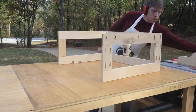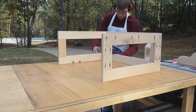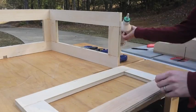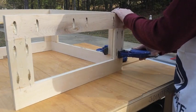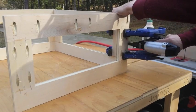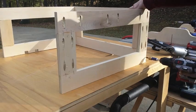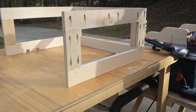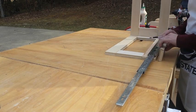And in this shot, I'm about to make mistake number one in the project. The pocket holes that are facing up on the near side of the frame are actually to mount the frame to the workbench itself, and I mounted that portion of the frame upside down, so I had to re-drill those pocket holes later on. Following finishing assembling the frame, I mounted my drawer glides.